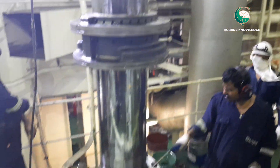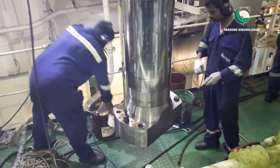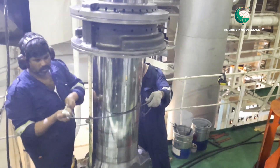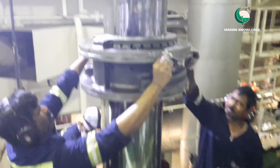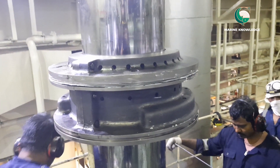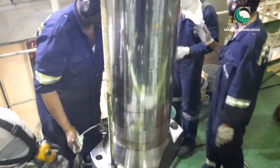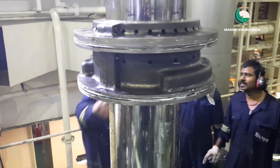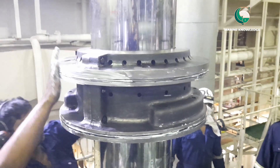After cleaning the groove area, the next step is to fit the O-rings. This stuffing box has two O-rings. For fitting, use white grease on the O-rings. Once the top O-ring is fitted, ensure it is not twisted — that is the main thing to keep in mind, because if the O-ring gets twisted there are chances for it to get cut. Now the second O-ring is being fitted and given a good coat of grease, which prevents damage and helps it sit in place.